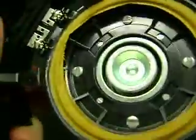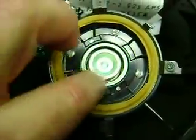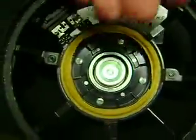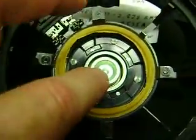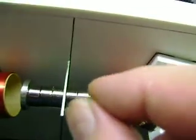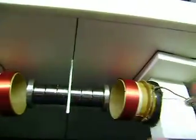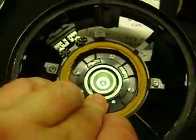This here is where the coil came out of. This magnet — say it's north on this side — so this plate grabs up most of that north field. And then this lower plate, that silver plate looks like a big washer with a hole in it, is the outside ring here. By bringing those close together, the field is really concentrated around there. It's going across the coil, all around the coil — the coil is soaked in magnetic flux at that point, a very strong field. So it's very efficient compared to what we're doing here. This big balloon of flux out of this end has to be at right angles with the coil in order to generate a current through it. So this all is very inefficient. If we can get this involved with this project, I think we can get it to be much more efficient.